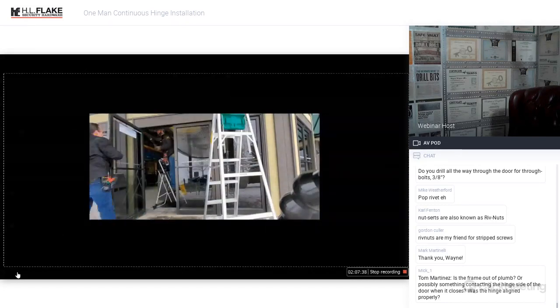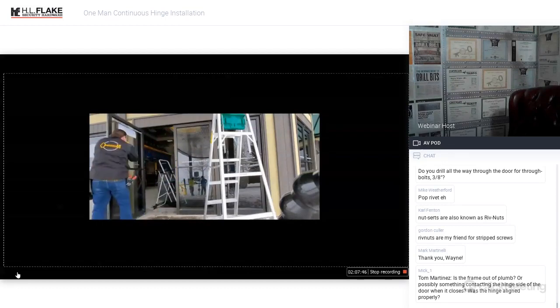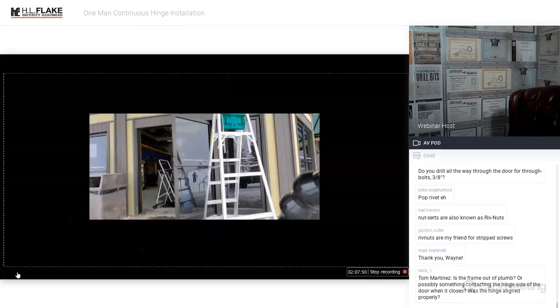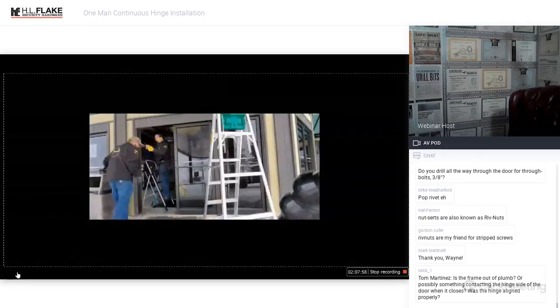There will be between 2 and 3 Allen head screws that hold a block onto the arm that is attached to the door, where the block slides onto the square pivot for the center hung door closer. We now have the door pulled. This is a scenario where it would be advised you will have to pull the door down.